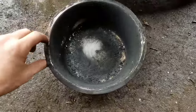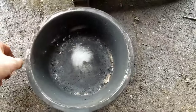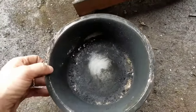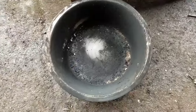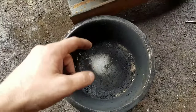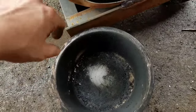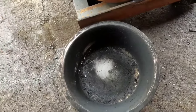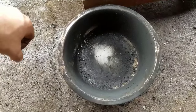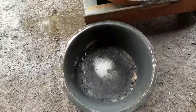What I'm going to use for my burn chamber is a stainless steel dog food pan. The goal is to get this — it's real thin, it's stainless steel — hot enough where actually when oil hits it, it'll vaporize and burn. I tried it out, didn't even have it really hot, and I could drip oil on top of that brake disc and it would just ignite. So that's the goal. I don't think I had enough air to it before and I didn't have my drip feed set up, so I'll show you a little bit more about this.